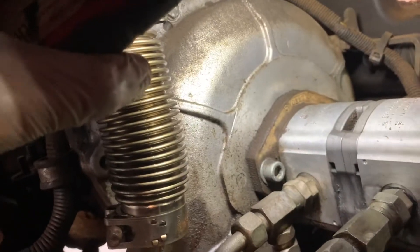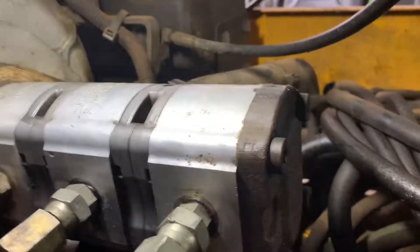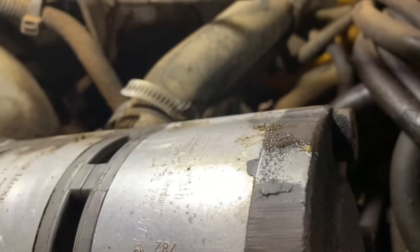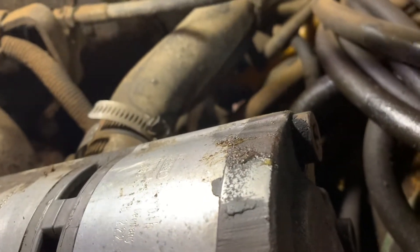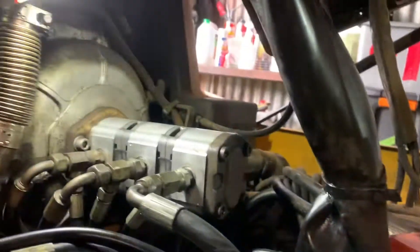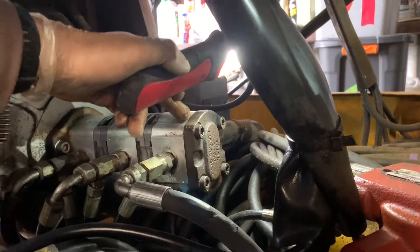The other thing is the vibration. Right on the end of the pump — that's the engine, and that's the back of the machine — right on the top here there's some sort of rubbing. You can see it: lots of grey colour and then bare metal, and then a little rusty patch just over the top there. When you look up at the bottom of the cab, it correlates with this area which I think is designed for the pumps to slot into, with an area right in the middle which has also been rubbing, and then something to the right as well.